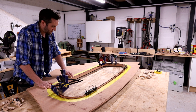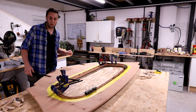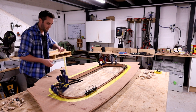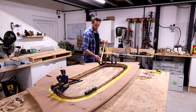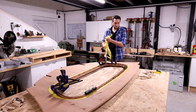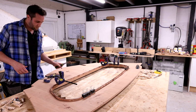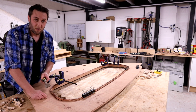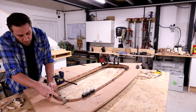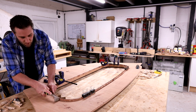this tape off now and just clean up the worst of it. So I've not got to contend with fully hardened epoxy. So I can get the tapes pulled. And a quick run around with a carbide scraper means we can just clean up any of the squeeze out we've got going on here. Get the worst of it off before it goes like concrete.